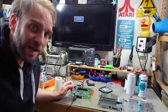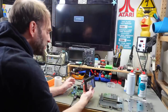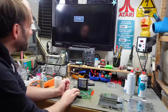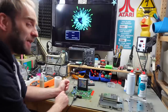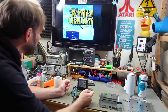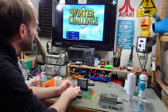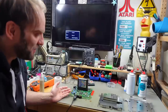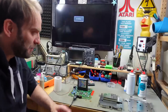While the case parts dry in the kitchen, I cleaned the RF shields and also cleaned my cartridges with Q-tips and isopropanol. I even got Winter Challenge to work reliably now — it really was just a matter of cleaning the edge connector on the cartridge itself. It had nothing to do with the Mega Drive. So I guess this is a fully working Mega Drive, and as soon as the case parts are dried and cleaned completely, I'm going to put it back together.